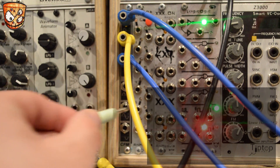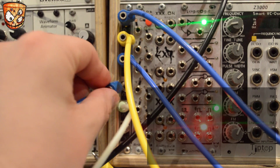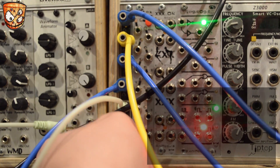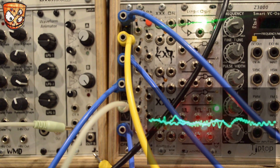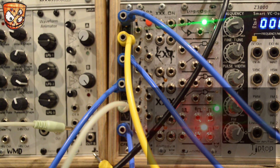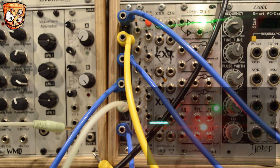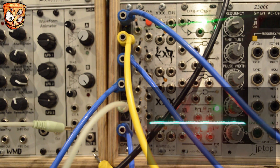I'm going to use the second half-wave rectifier to combine waves. Here's a square and a saw wave from two different oscillators, and they're running at different frequencies. This is something that potentially won't line up and actually repeat, as they're getting different modulation based on the positive part of one signal and the negative of another, but they're actually running at different rates, which creates a lot of overlap and more complex elements to the modulation. So using the unit to combine sources has given us some really nice complex changes that seem more alive and fluctuating in their values, and a much more developing random style of modulation.